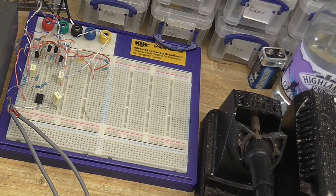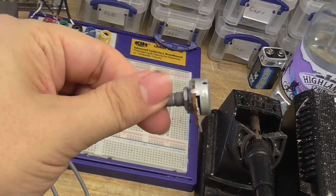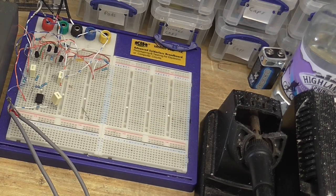Here we are with the fixed resistors in place of the potentiometer. So this way I've got no way to adjust the common mode rejection ratio, so I really don't know whether to use this, which might be slightly noisy, but I can get the common mode rejection ratio adjusted properly, or to go all out with the metal film resistors.